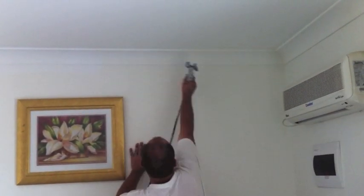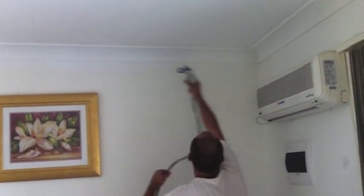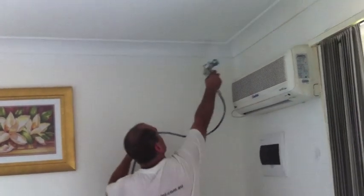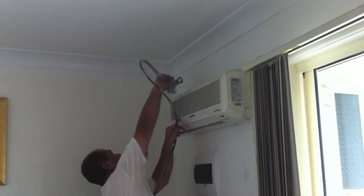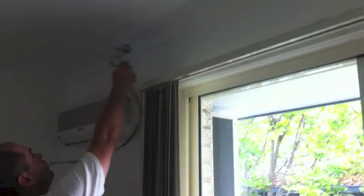As far as the flat paints, this is a flat ceiling paint that you get, flat plastic it's called. There are different flats. Some have got a sheen, like a 5% or 10 or even 15% sheen on a flat, and some have got none. There's a Hadrian contractor paint, which has basically got no sheen at all, so you'll get perfect ceilings every time. When you get flats that have got a 10 or even 5% sheen, if you're doing a big ceiling with light streaming along it, you can run into problems, get joins and things like that. Whereas if you're using a 0% flat, you don't have any of those problems usually, and you can sometimes touch it up right in the middle of the ceiling and you won't see it.